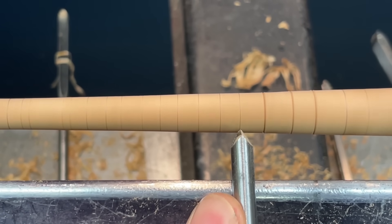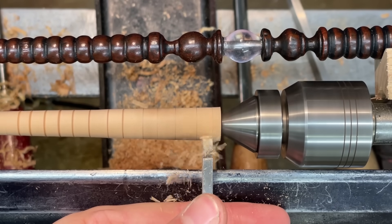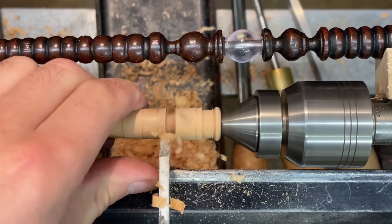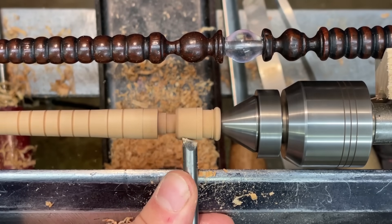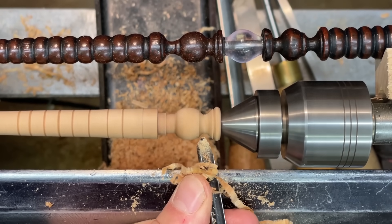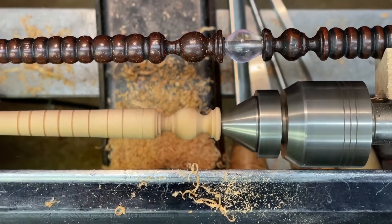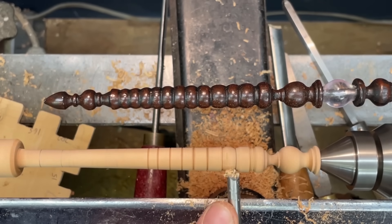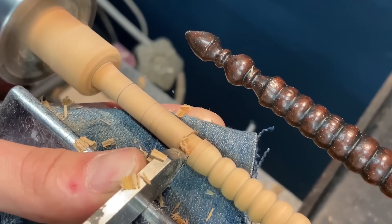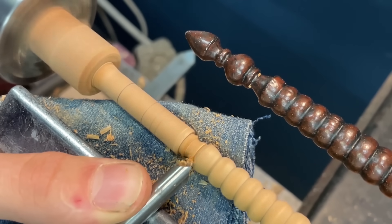This is a good little test — it's just to try and split the pencil line. So when I'm turning something like this, I will always work from right to left, and that's basically to keep enough wood on the left side of the lathe because that's where it is driven from and that's where all the torque is coming from. And you'll notice I don't actually measure any depth for all these shoulders and fillets — that's because the outside of the wood is the perfect diameter since it was a straight taper. With a lot of experience you can just learn by eye, see what is correct, and get all the proportions right.